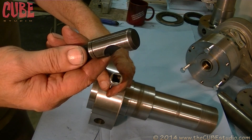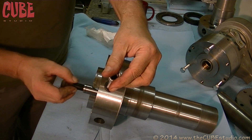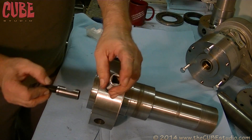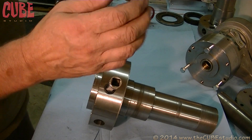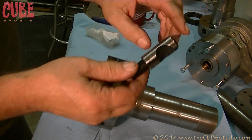Here's the pin for the chuck. This goes in like that. When this is not there, it won't go in — it has to be locked up. When this goes in, there's a line on it. That line should be, when you put this in your chuck, even with the surface of the chuck. That's what it's there for — it's a little gauge line.